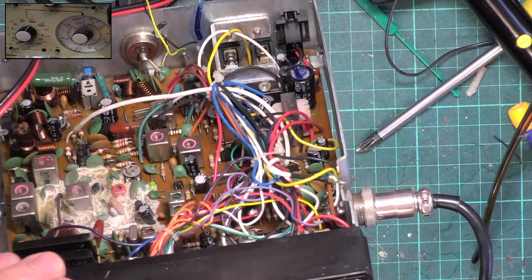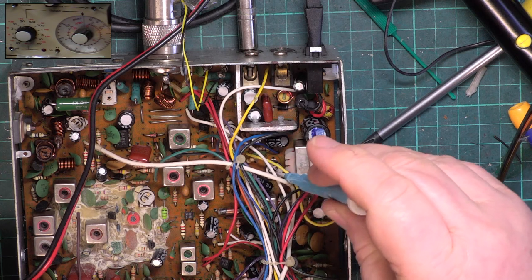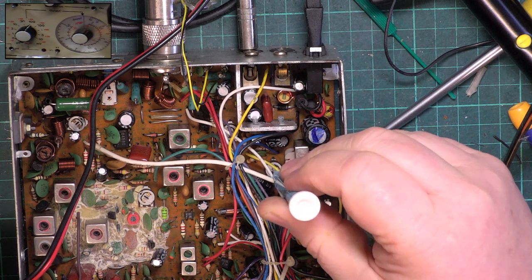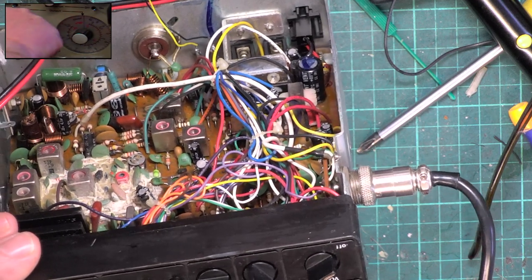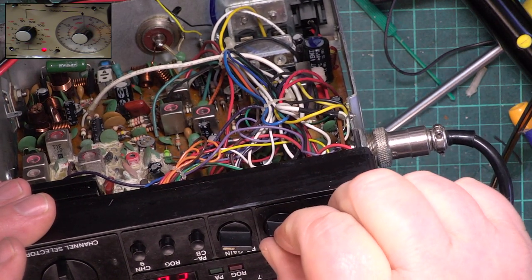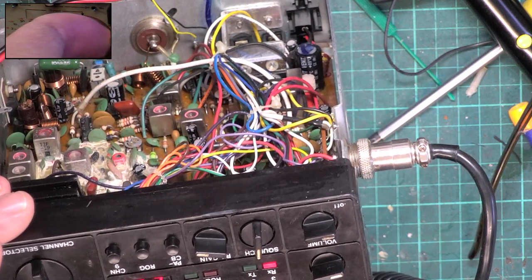So if I turn squelch to full, that's 10 microvolts. So let's see whether we can get more than that out of it. I'll turn it to 30, turn it to 100 in fact. Tell you what, we can. I'll tell you what, that's set up properly, 100 microvolts. Right, we'll take it down, we'll turn the signal generator off and park it at 0.3 of a microvolt. We'll turn the squelch down to threshold, set the squelch. And now switch the signal generator on. It's come straight in.